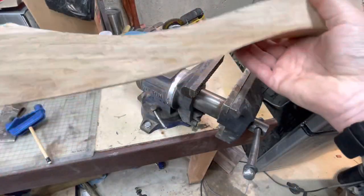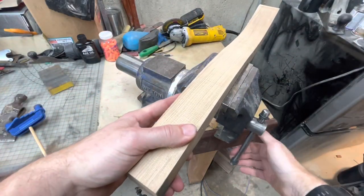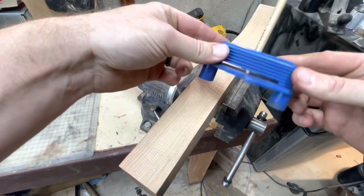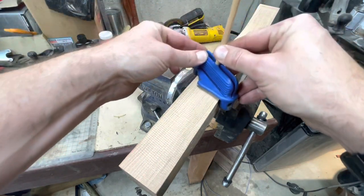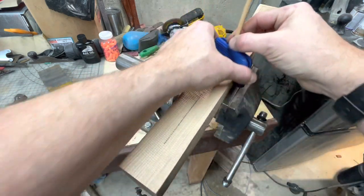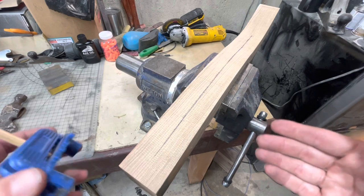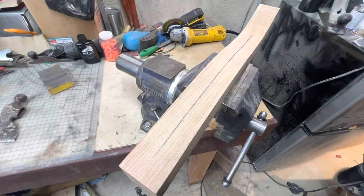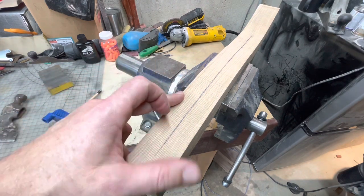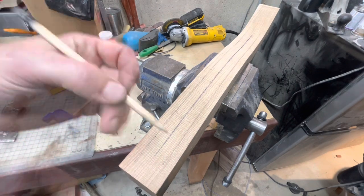All right, we got our blank cut out. Next we want to get our center line. I'll put it in the vice here. I use one of these tools that kind of auto-finds your center line, but you can obviously just measure and mark it with a square. It doesn't have to be dead center — this is just a guide. You're going to end up shifting around a lot depending on how the head's fitting or whether the eye was crooked. I'm going to measure about a half inch on either side of the center line, and that's the area I'll essentially cut out.